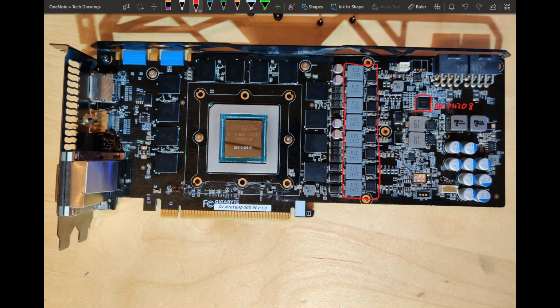You see this a lot, actually. Palit used this on their Jetstream cards as well in a very similar VRM, and so is Gigabyte. So yeah, it's a pretty typical 8-phase controller. You can get some custom voltage control on it in software. On this card, you just have to switch MSI Afterburner into extended MSI mode, and then you get up to 1.3 volts voltage control, which translates into about 1.25 behind the core because there's voltage loss over the power plane, but at the VRM you're actually getting 1.3 volts.